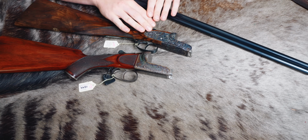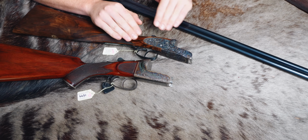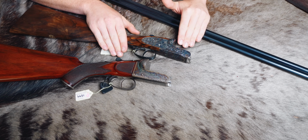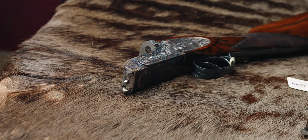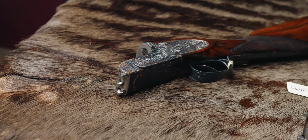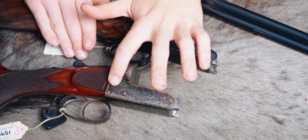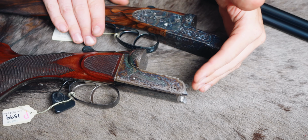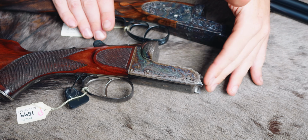To actually harden metal correctly, in the modern era at least, firstly we're using super high quality steel by comparison to what they were using 150 years ago, but more importantly, when we harden something, it is done in a different way. Because that process can lead to warping, can lead to some issues, and is fairly inconsistent. In fact, if you look at the colour pattern here, if it was consistent carbon taken on into the surface of this metal, it would be a consistent colour, wouldn't it?